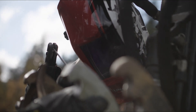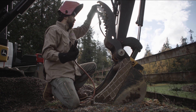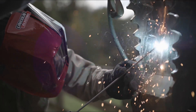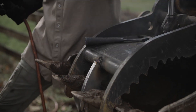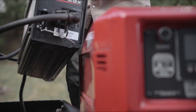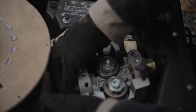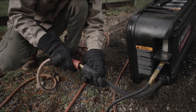The Ranger generates such clean power that it feels like it's plugged into the wall. There are a couple little gaps and stuff, so I'm using an eighth inch 6010. That arc stability is just really, really nice. We're using a Lincoln 71A85 in .052, which for a lot of people they would say that's a large diameter wire — it's my favorite diameter to run.